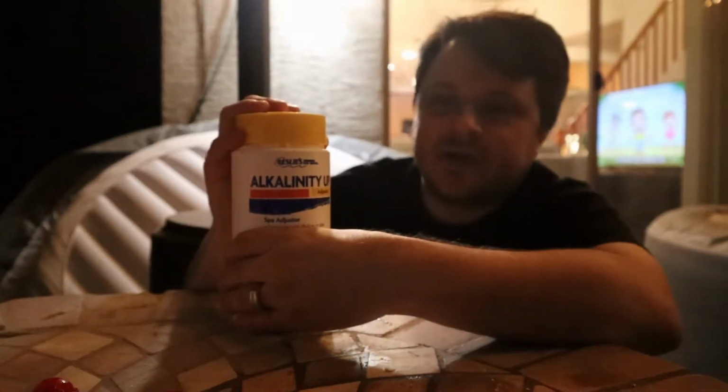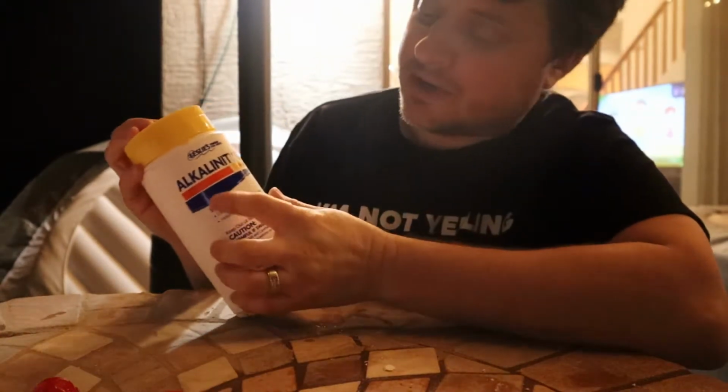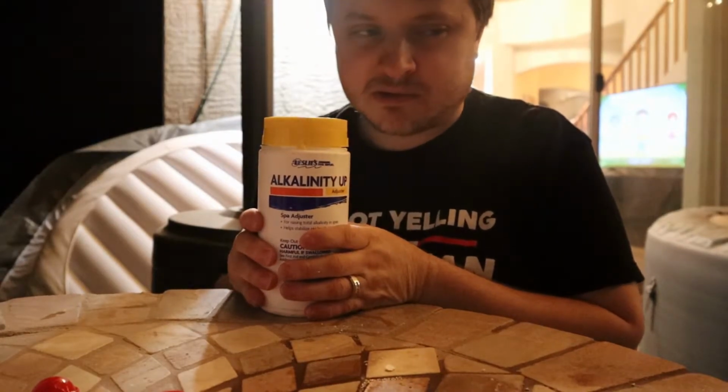The next chemical I have is Alkalinity Up. Now this will raise your pH, but it will mainly raise your alkalinity. That's why it's called Alkalinity Up. A lot of people will tell you Alkalinity Up is the same as pH Up. They are actually two different chemicals.